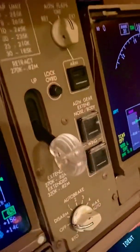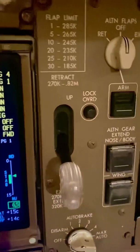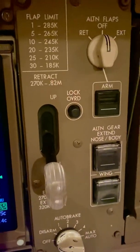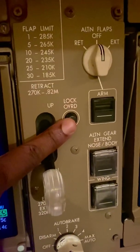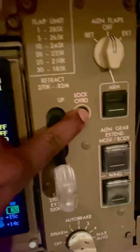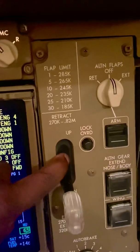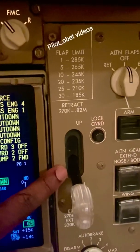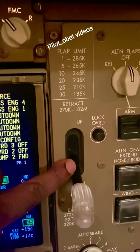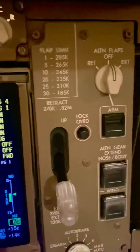Up and down over here. Sometimes the landing gear may fail — you may fail to raise it after takeoff. Provided you're certain there's no damage caused, you would press this lock override and push it in, then raise the gear. That removes the catch that's in there — you can see there's a catch that moves away after liftoff if everything's okay with the landing gear. If it doesn't release and you still have to raise the gear because there's a greater emergency, you could push that and raise whatever gear needs to come up.